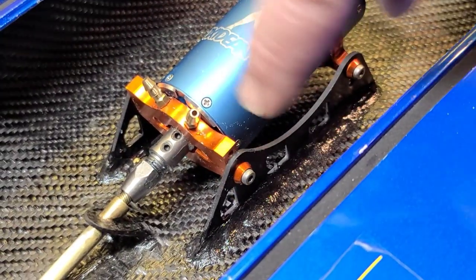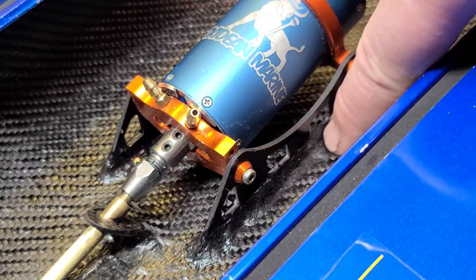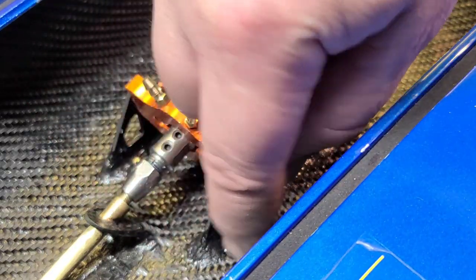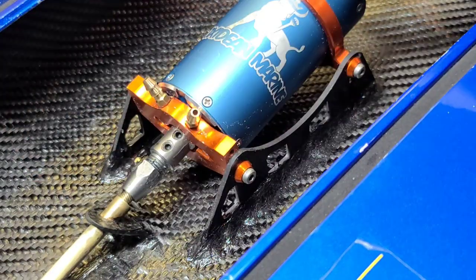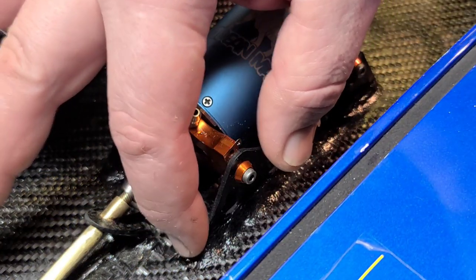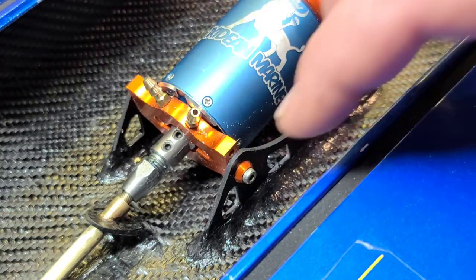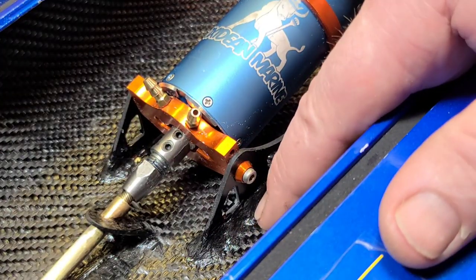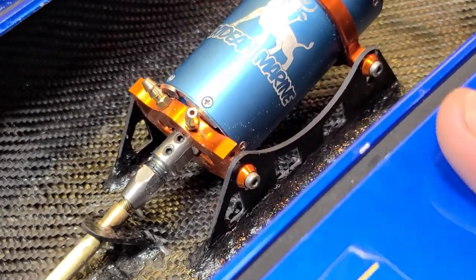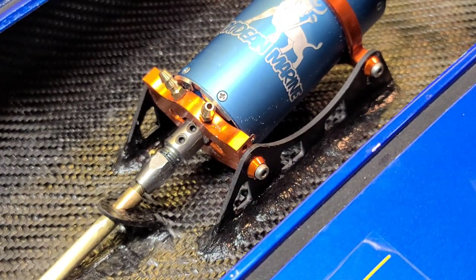So like you guys seen, I just used my epoxy carbon fiber mix. I went around the outside of the rail on both sides, around the ends of the rail, forward and aft, okay? And it's actually set up. It's still tacky, but it's not sticking to my fingers. So you see how it's got little grooves and rough spots, you know what I'm saying? It looks good, but it could be manicured to look a little bit better.